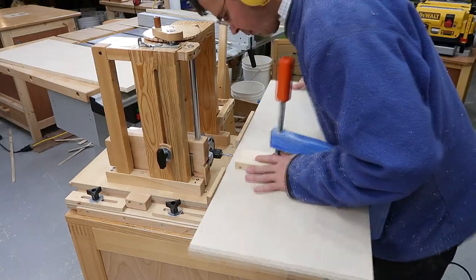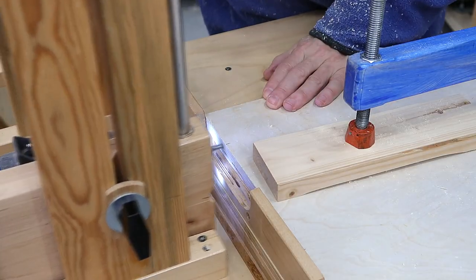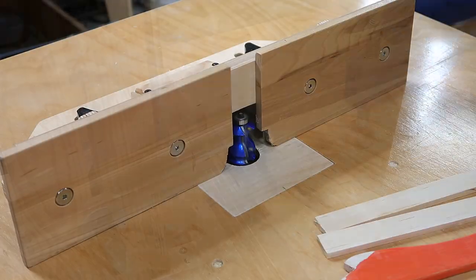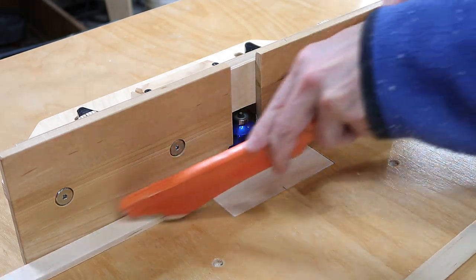And now a corresponding set of slot mortises in the plywood that goes between the frames. I haven't got a quarter inch half round bit, but part of this fancy moulding bit has got a quarter inch half round on there, so I'm using that to round the edges.